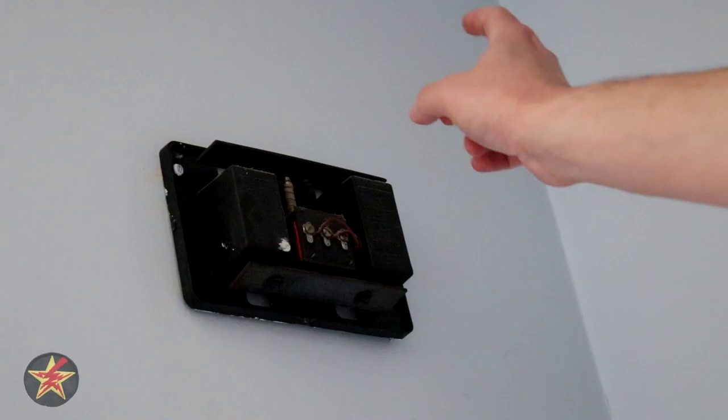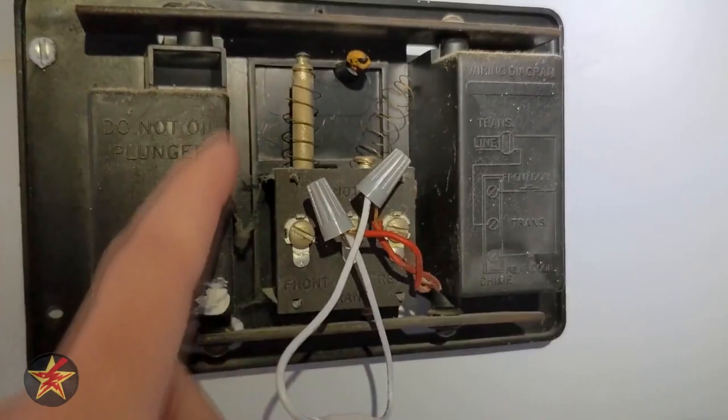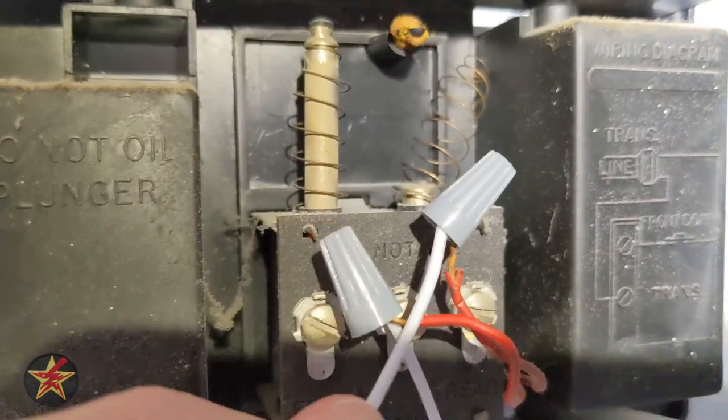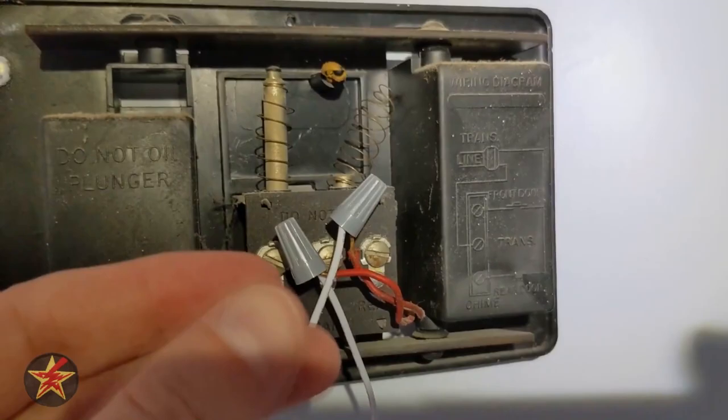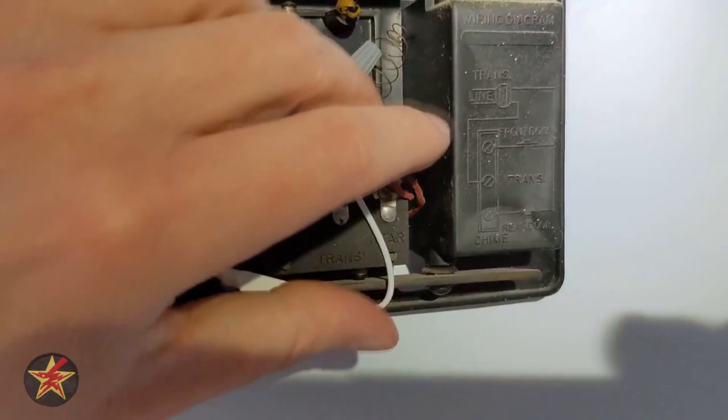The bypass wire and caps are not terrible to actually install. You don't really need any extra tools except for the caps here. The wiring that you probably have in your chime box are the thicker cableage. However, the bypass wire are those feathery ones. So you actually just need the cap, twist them together. You don't actually have to twist the cableage together before capping them together. So once you get that wiring in, you'll just kind of tuck that in neatly somehow